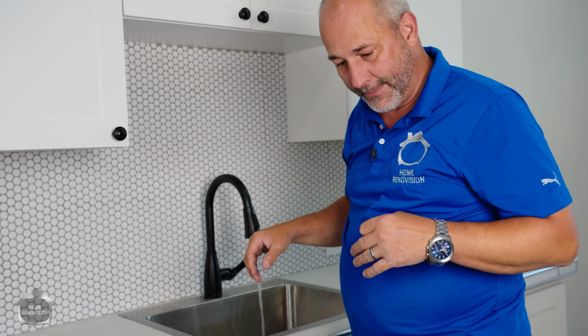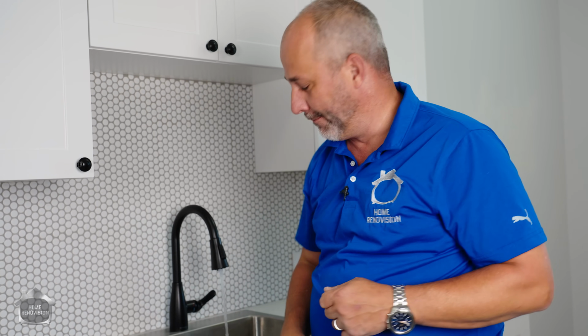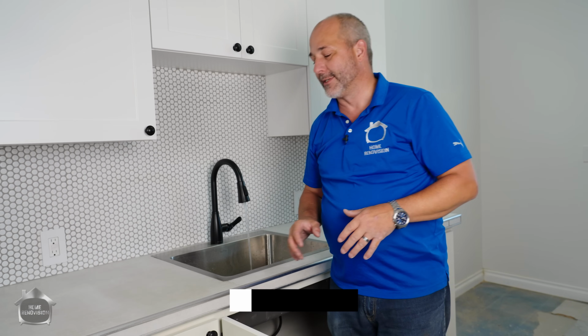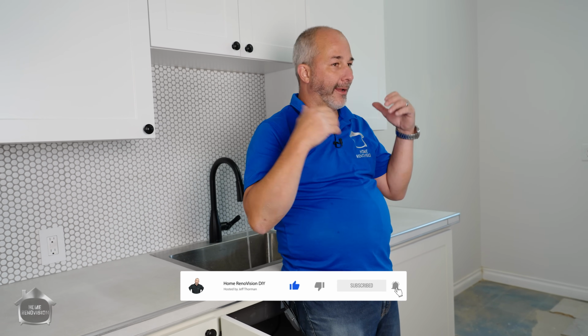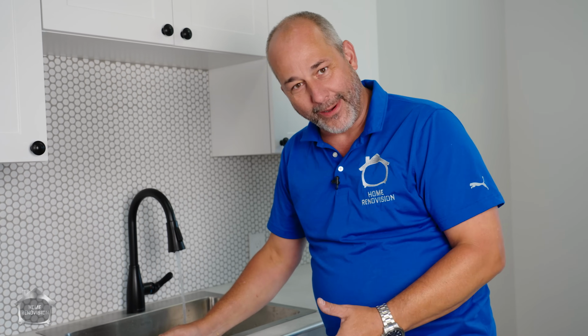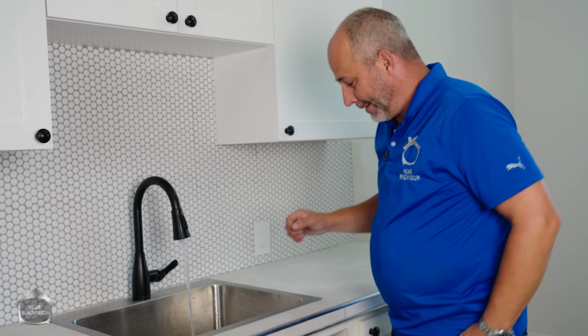If there is a place in the compression fitting where the Teflon is, sometimes it can take 5 or 10, 15 minutes before the water finds its way around all of that and starts leaking. And then you get a slow drip. So now you put it on the cold water and you just let this run, okay? Can't even tell you how many times in my career we would do a water test, first and second stage, and not do this. We go home and then we get the call on the weekend, hey, the sink is leaking. And so take the time, make sure you're not gonna have a drip. A little bit of water causes a lot of damage, especially on a painted wood surface, if it's left unattended, all right? Oh.